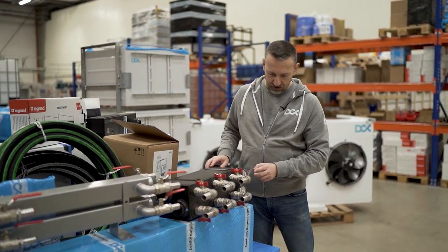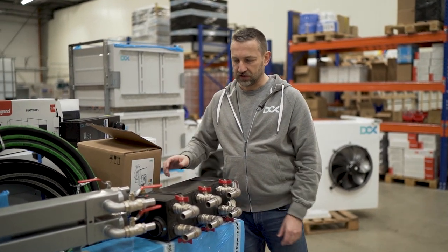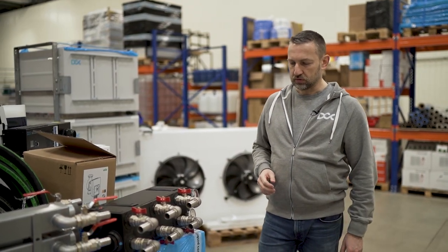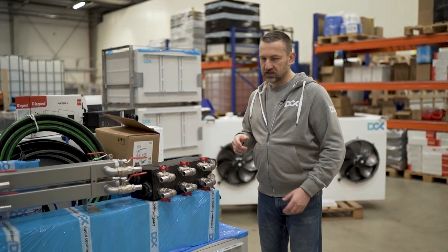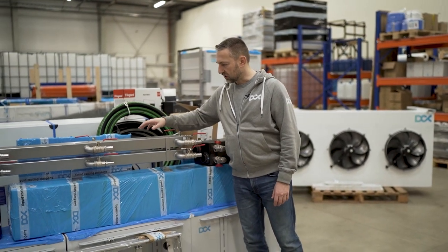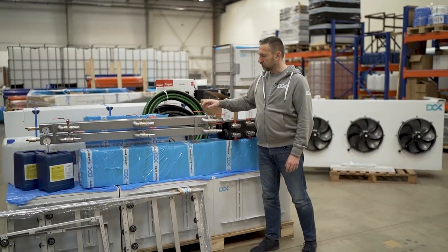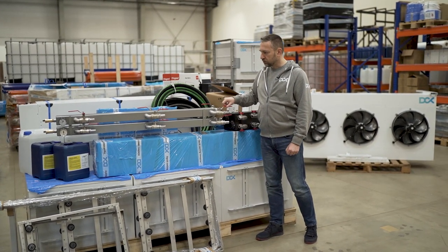And so we have the thermometer, manometer, air vents, and inlet valves. We have the expansion valve, not to be seen here, and that component should be mounted nearby the rack to supply the flow to the enclosures. We recently changed that unit since our customers expect more scale-out packages. We are shipping and changing that unit to the rack manifold, which is exactly the same. It's a little bit bigger, but the new frame allows us to mount it on the frame and to supply the flow for the two nearby racks.